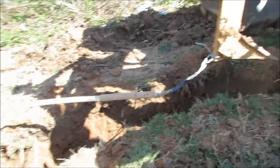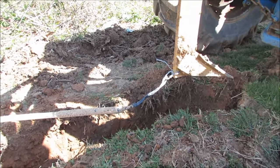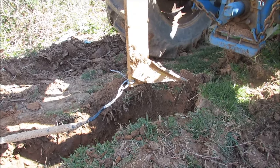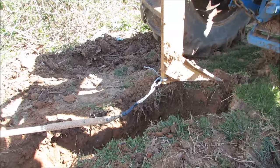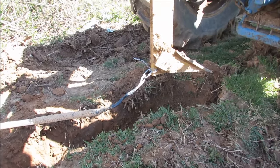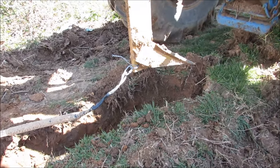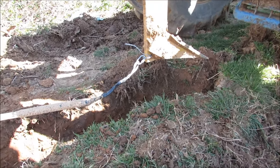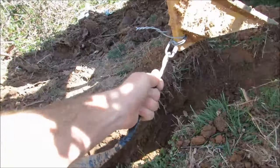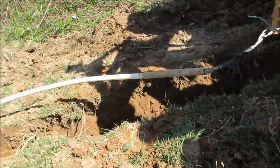The Kellum's grip ripped apart about halfway through the pull. I think what happened is the hole I drilled had some sharp edges, and it's kind of rocky here - the rocks may have shoved the cable part of the Kellum's grip into those sharp edges, causing it to cut through. So I ran some high tensile fence wire through the hole a couple times, put a carabiner on it, and remade the loop on the Kellum's grip as best I could.